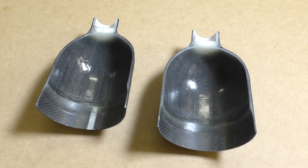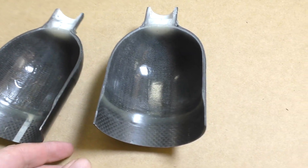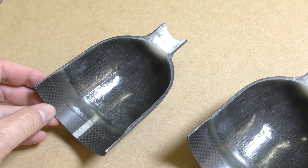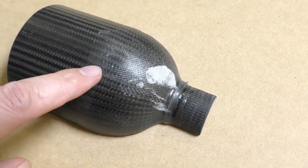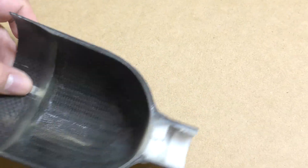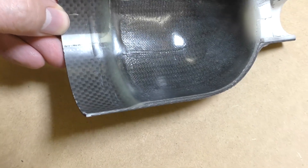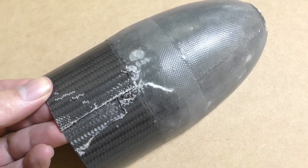Here's the inside of the top end cap. From a first look, it all looks nice and clean and smooth — there are no obvious cracks in the walls like we saw in the previous one. The join between the end cap and the body tube looks a lot better as well. It's hard to believe this much water came through without any obvious path. Looking at the outside damage, we can see water ingress all the way up to a certain point, in direct line with the tape. Perhaps the air is leaking along the tape and entering between the two carbon fibre layers — this would explain why no obvious path exists from the inside. Comparing with the previous pressure chamber, where the water came out was also right near the tape. I think this must be the culprit.